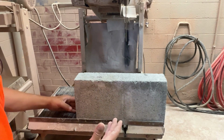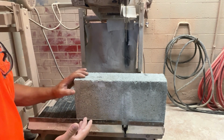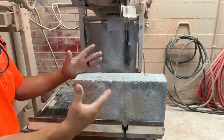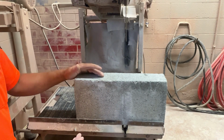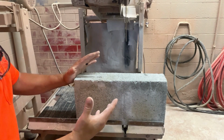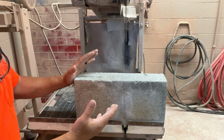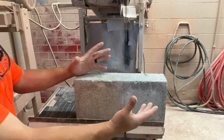Well, now we need to know what is the length of half of a block. We're going to need to do a little bit of math. We can buy these blocks as factory halves. They come from the factory already in half. They're made that way. If we're cutting a block in half, we need to think about some measurements. The overall length of a block is 15 5/8. We would like to have 7 5/8 as a half block. Only we're not going to make it that size. Well, why not? We want to be able to cut this block and get 2 pieces out of 1.